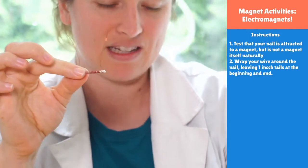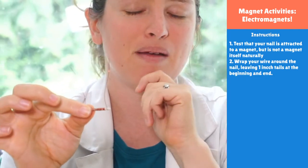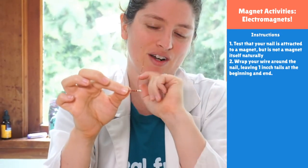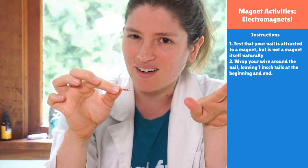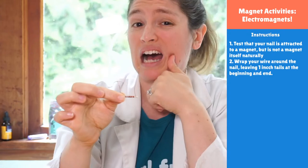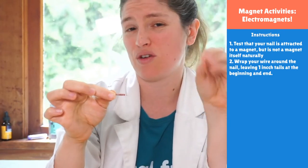The reason why I like to use these smaller ones is if you've been in circuits class with me before, you might be like, wait a second, Dr. Erica, if I connect a 9-volt battery straight across to one wire, you might know what happens. And that is your wire will get really hot because you're not putting it through anything. There's nothing that's slowing those little electrons down.